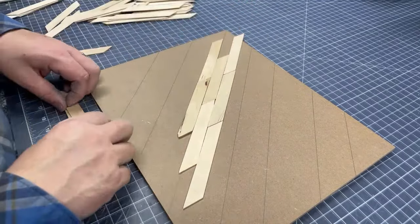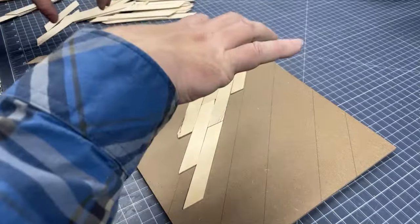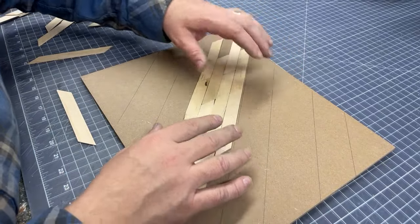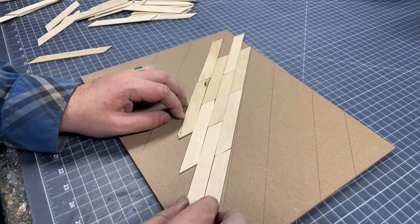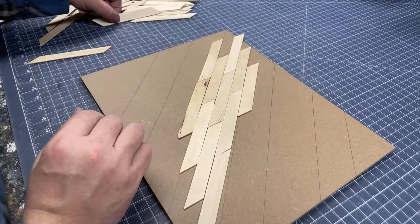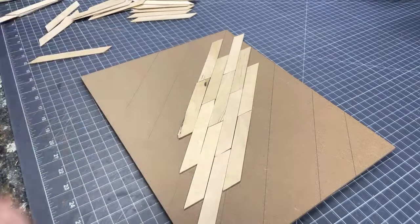This one's going to be fun too, because I'm going to have to constantly keep something clamped on it because of the wood glue. This stuff will want to warp because it's so thin, kind of like balsa wood. Or I could use a non-water-based glue, and that will make that happen less. Like I could use epoxy, or I could use spray glue and then layer it with a layer of resin or something later to prevent the pain of me having to constantly clamp things down so that it doesn't peel up.